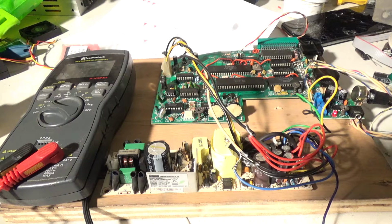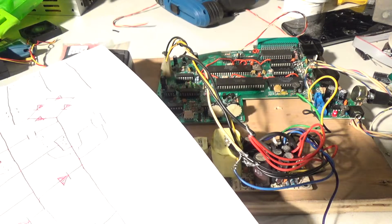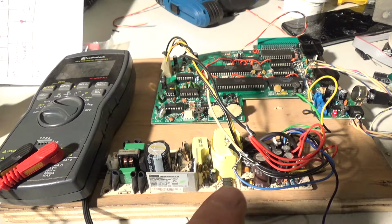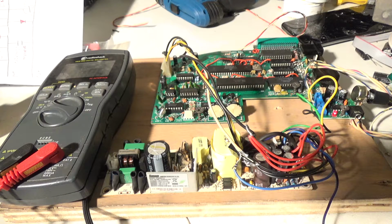Well, I guess it doesn't need that much power. So, I guess I'll screw this sucker down. But man, that still pisses me off. I was convinced this stupid schematic was going to work. So, let me think of a more permanent solution. Since this takes so little juice to run on the negative 5 and the negative 12 line, I may just put some heat shrink tube around this and tape it up and hide it in the harness. I don't care, as long as it works. Alright.